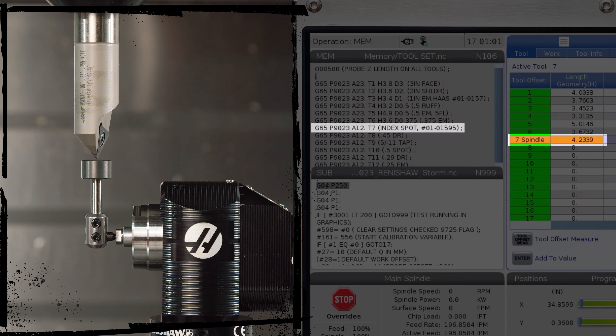We need to shift larger tools over when probing. Tools that need to be set at their edges are what I'm calling not-pointy tools. We have a different cycle for all of these not-pointy tools, like shell mills. A shell mill cannot come down directly above our tool probe — at best it would give us an inaccurate tool offset, and at worst it might actually crash into our tool probe. We need the shell mill to move sideways, offset by the radius of the tool, before perfectly probing its edges. And that's what this cycle does.